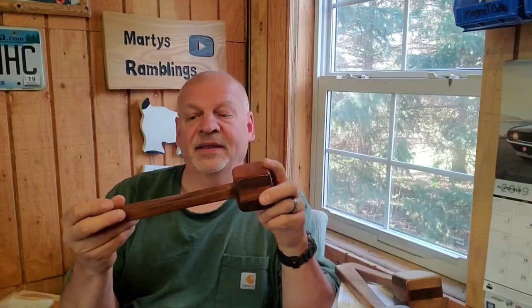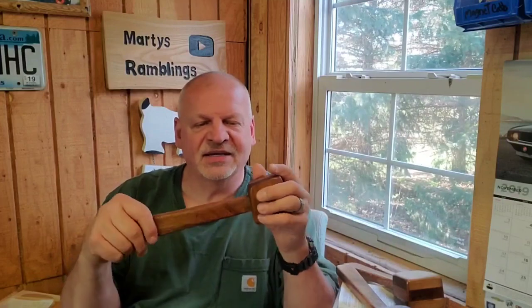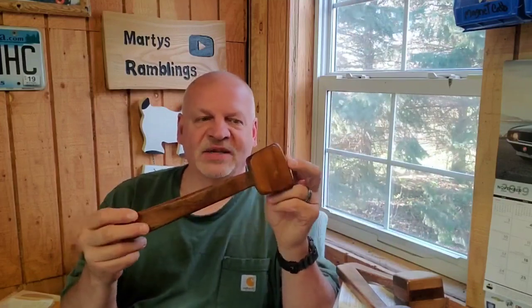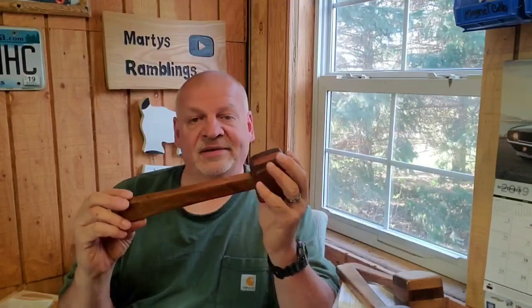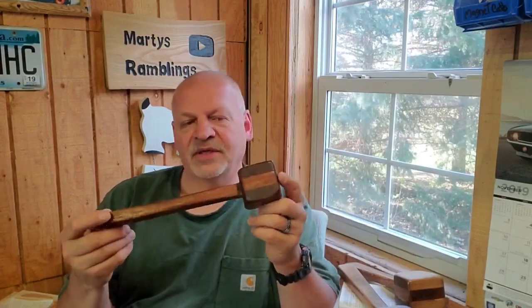After the glue is dry, you know, glue and clamp it. And then when the glue is dry, you can router. I took a router along all the edges, and then I sanded it nice. And then I wet it down with water to raise the grain, let it dry, and then I lightly sanded it again. And then I put Danish oil on these. But you can use any kind of Danish oil, tung oil, any kind of oil, any kind of stain, clear coats, whatever you want to do. But that's what I did on these.